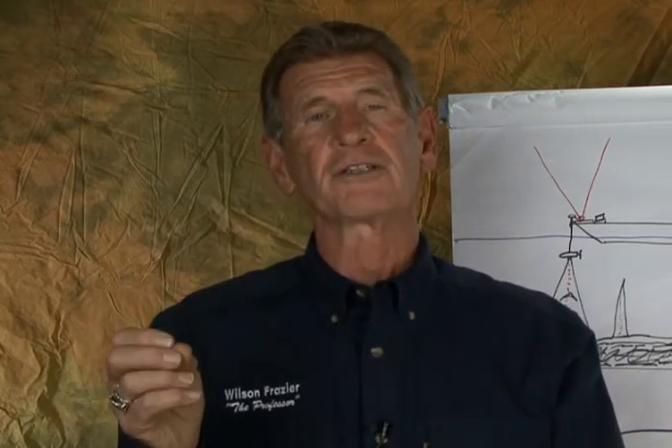Wherever you were last, when the unit boots up it automatically goes to where it was when the lights went out — in other words, when it lost its signal. It remains at the last known position when it lost the signal. So you need to go back, check the status, and see if your antenna is working. If it is working, give it a minute; but if it's running really slow, you might see about getting a firmware update. If it's Lowrance, you can get one off the website and update your unit.